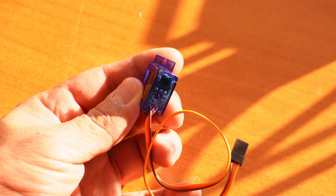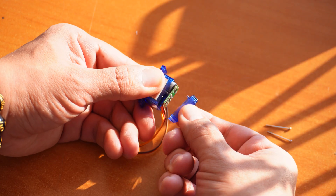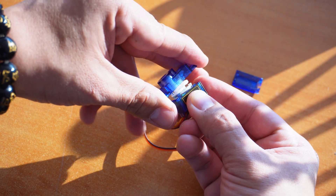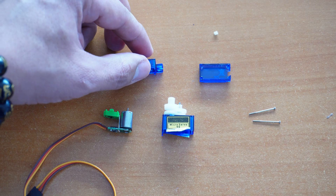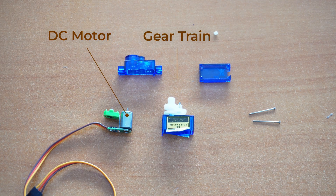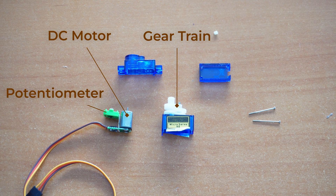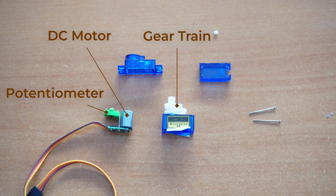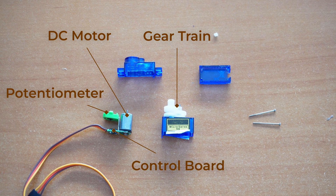The housing usually has two holes for mounting and the upper gear is where it actually rotates. See the two screws at the bottom — only remove them if you plan to open the whole thing. There are four main components that make up a servo motor: a tiny DC motor that spins very fast, a gear train to slow the rotation down while increasing torque, a potentiometer which tracks the rotation angle, and a control board that speaks to the potentiometer and manages speed and direction.